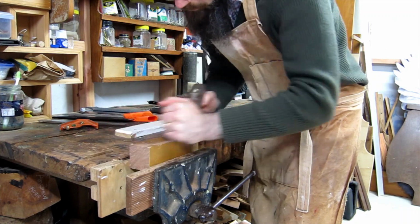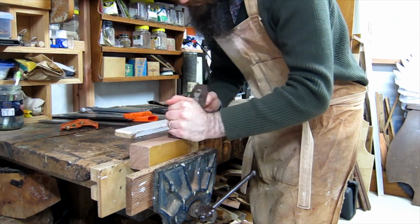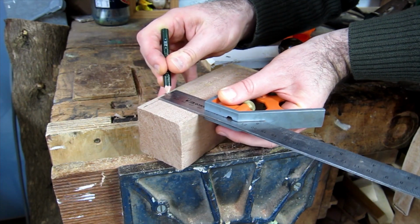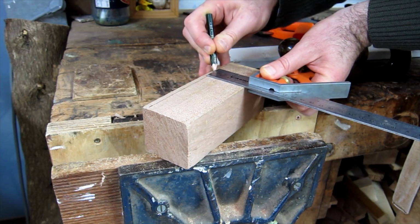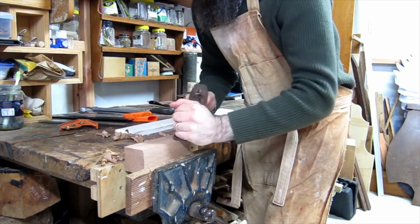The next step is to cut your wood down to the rough overall dimensions. Use your template to make sure you have the right width and thickness. I've used my bandsaw to save time, but you can also use a large carpenter saw. For a very small carving such as the Netsuke style I'm making, I'm keeping a length of wood attached so I have something to hold onto or clamp in a vise while I'm working on it.